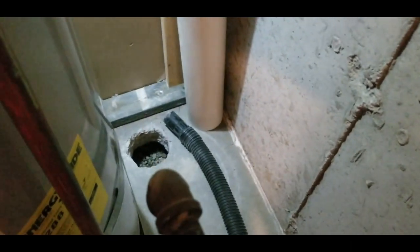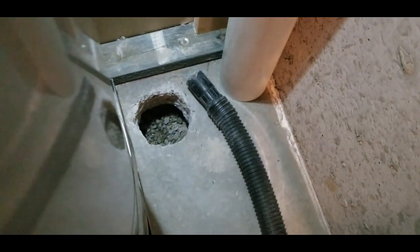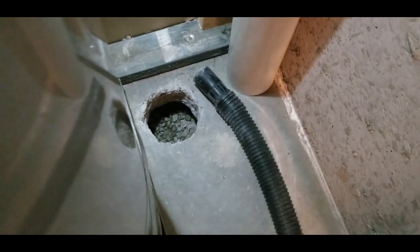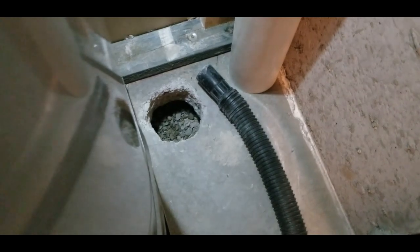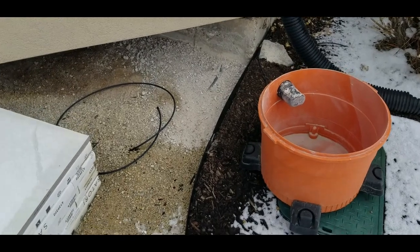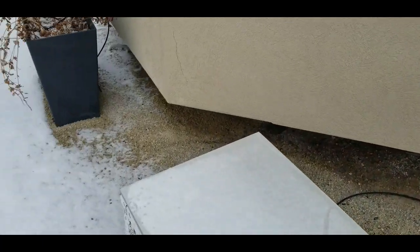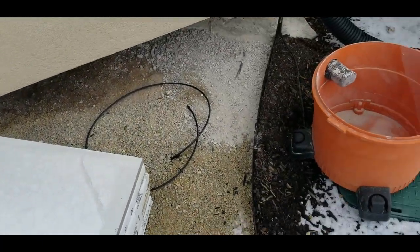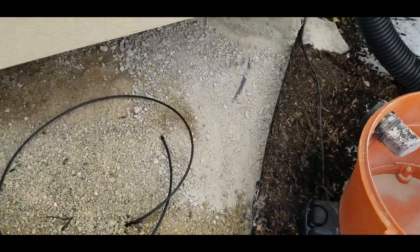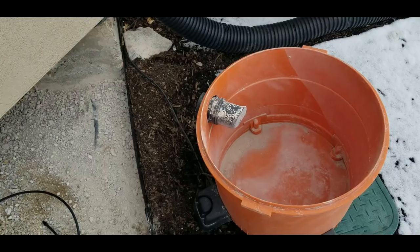So that is what I'm working on now. The awesome thing is this vacuum sucks up that gravel pretty well. You're supposed to dig out about five or ten gallons' worth of material so there's an air gap underneath where this can draw air into the suction point better. I'm going to use the vacuum to suction up a bunch of this gravel, and it's working well so far. Another cool thing is I don't even have to throw away the gravel — I can use it in my yard. We xeriscaped part of our yard last fall and I can put some of this gravel there and get a fresh top coat of gravel over it. It's nice when you don't have to add things to the landfill.